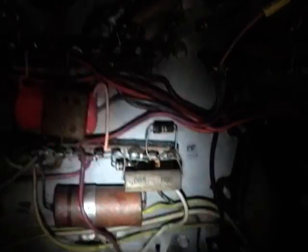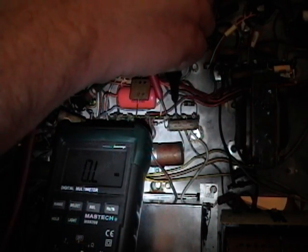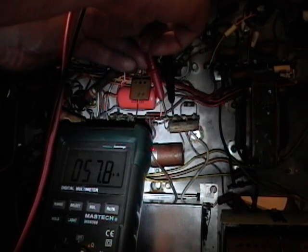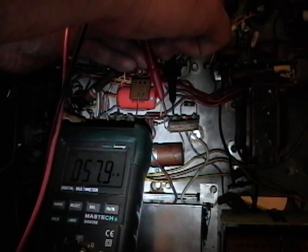I'm going to check these resistors, and if they're off I'll be replacing them and will unsolder everything. Otherwise I'll just cut the leads short. Let me grab a meter. This resistor is supposed to be 47k — let's see what we've got. It reads 57.8k. As I mentioned before, resistors tend to drift up in value with age. That's pretty far off, so I'm going to actually remove all the solder from that terminal.